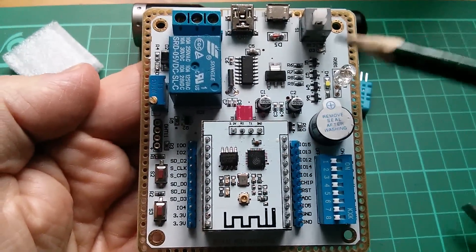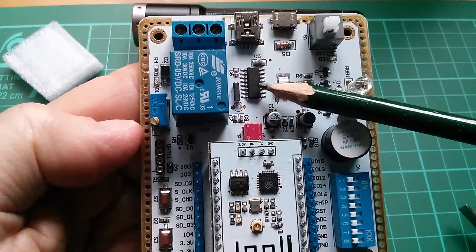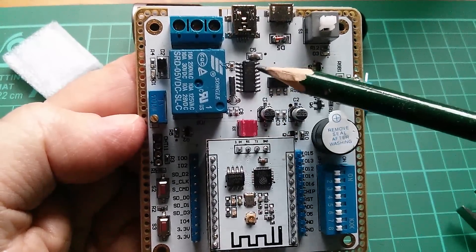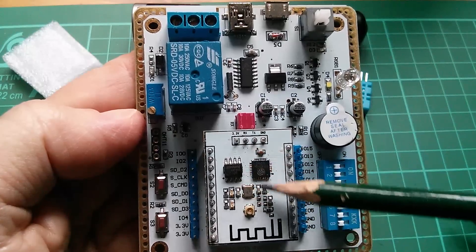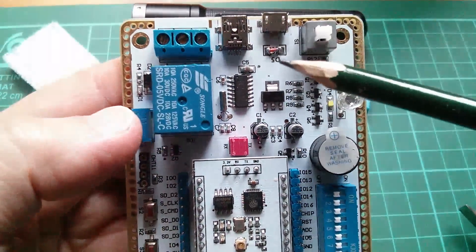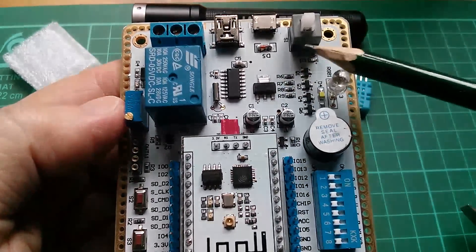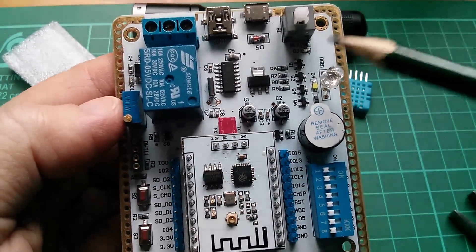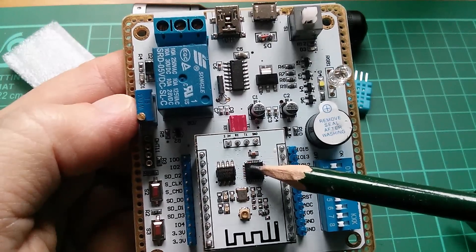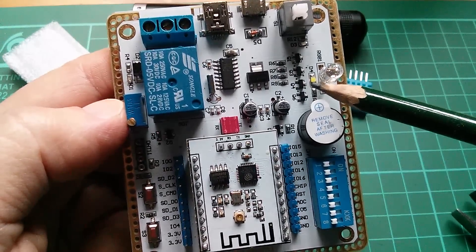So let's have a look at what's on this experimenter's board. We have a USB mini here which goes to the CH340, and it does also supply power to the board. There's a couple of links here to take RX and TX from this USB to serial converter into the ESP8266 module. This second USB port, which is a micro, appears to be just to supply additional power for the peripherals if they require it, and a switch controls that socket. We have a 3.3 volt regulator here to turn 5 volts from USB into 3.3 for the ESP8266. There's a red, green, blue LED here, and also a white LED down on the board.